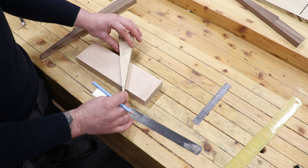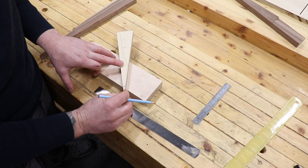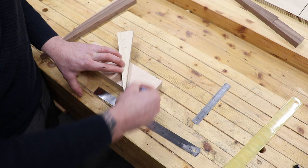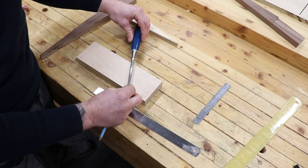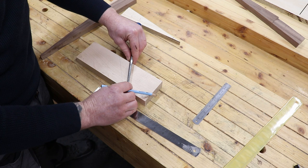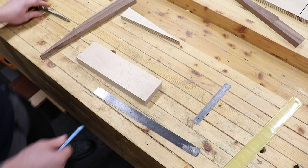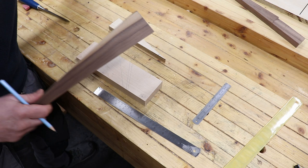I've also marked back an inch here - I want the chisel to protrude a small bit, and that's where the ramp would have to start. I'm going to line that up with the bed of my plane, leave it protruding about an inch, and mark that angle. Now we also have to account for the chisel itself - as you can see, the chisel tapers, so it has an angle to it. I'm going to add that taper angle to the wedge angle by lining it up straight with the line.